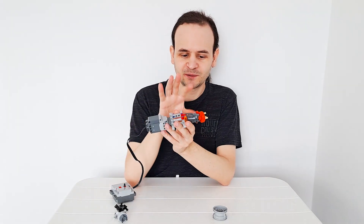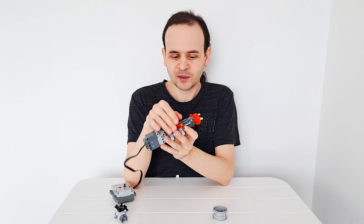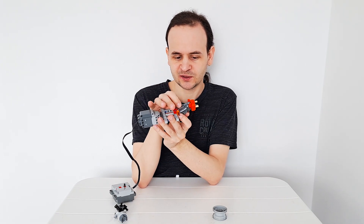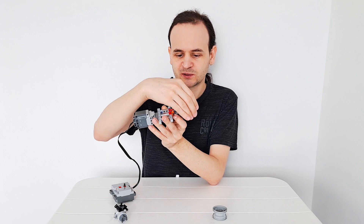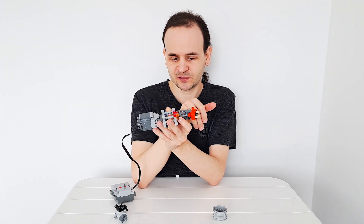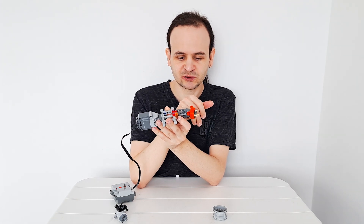I assembled the hub and put it inside the suspension arm system. The arms are two studs apart — very compact — and you can see it has the full range of movement. You can go up, down, and steer. The only limitation is the CV joint; the steering angle is limited to around 30 degrees.